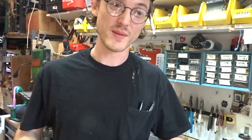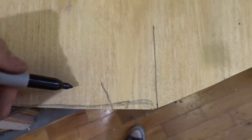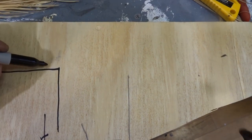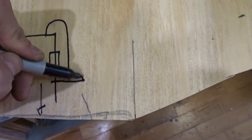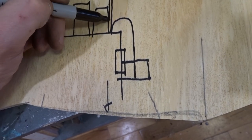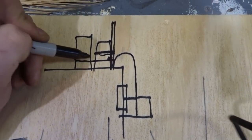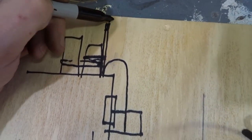It's going to be a pivoting crane, so you can imagine there's only going to be one connection point from the arm or the bar of the crane. If you're looking at my building from the side, it goes down three stories. Here you have the fire escape that comes down to the landing outside my window. Here's the fence of the fire escape, the ladder. Up here you have a couple of chimneys. What I'm going to do is take a 7-foot Schedule 40 plumber's pipe, round hollow pipe, and mount it to the chimney, bolt it in, maybe go around both so it's super supported, and into this T with the bushings will fit in, and that'll form the pivot point.